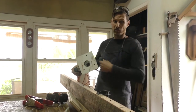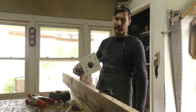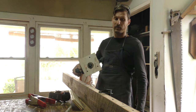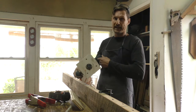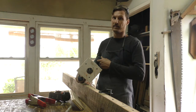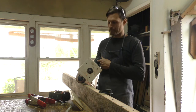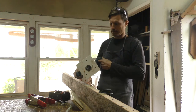These mortises are going to be 3 inches deep, which is relatively big. And well, relatively deep, they're going to be 3/4 inches wide. So pretty hefty mortises. The problem is I couldn't find routing bits that were big enough. Ideally, an upward cut spiral bit. They just weren't long enough. So I'm using a straight half inch bit.